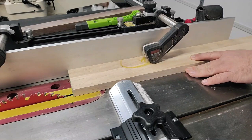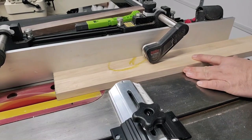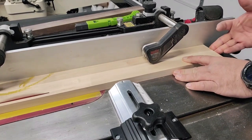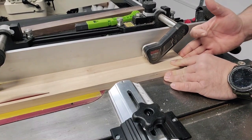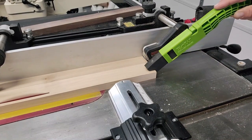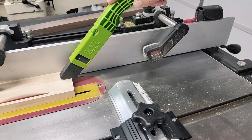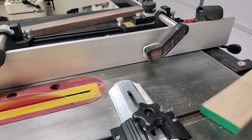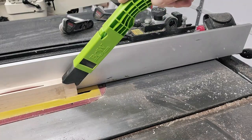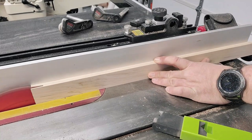So this is another product I got from a company local to me, close to Atlanta. It's the thin rip jig, and it allows me to rip the same size strip over and over by simply moving my fence over each time instead of having to move everything or use some other form of a jig. It actually works pretty good, and being able to use it in conjunction with the stock guides turned out really well on doing repeatable strips. I'll definitely leave a link in the description.